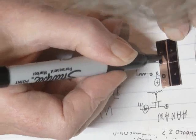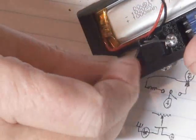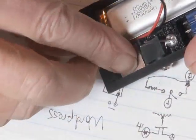To connect the stainless wire to the copper ones I'm using a time-tested method of screwing the wire to a simple 2 bus PC board which then can be soldered to. I've done similar to this in a saltwater environment and it holds up well as long as coated with grease after. Much better than just twisting the wires together.